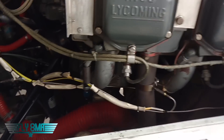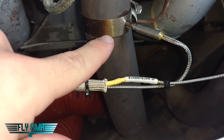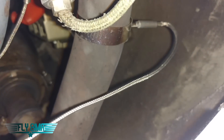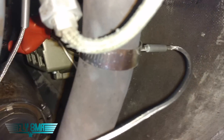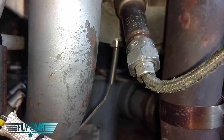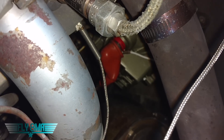So we can see here under the engine cowling where we have these yellow wires running through — that's our engine analyzer. They're coming down here to these little probes that are actually inside of the exhaust pipe. They've actually screwed a hole through the exhaust, sealed it off again, and then with a hose clamp, attached that little probe to each individual exhaust pipe. So you're getting EGT from each exhaust, from each cylinder. They also have probes for the CHTs — that is our CHT probe, directly into the cylinder head to get your cylinder head temperature for each cylinder on the engine.